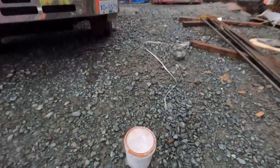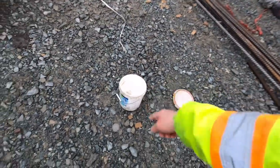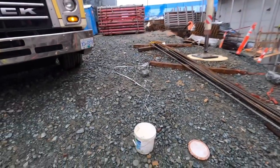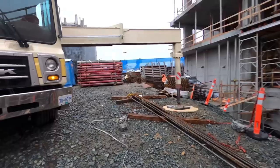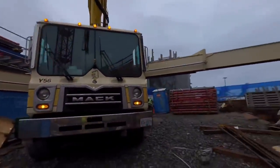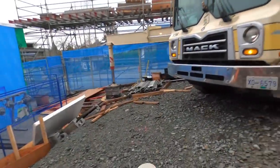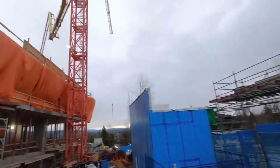That'll be it for today. A little bucket of bentonite right here - as you buy it, it comes in a 50-pound sack. You can probably fill this bucket five times over, so this bucket is about 10 primes - 50 primes per bag. We pay about $15 per bag - do the math, it's pennies per prime. We get the stuff from a local drilling supply store. It's called high-yield powdered bentonite - that's the name it goes by. In my opinion, 100% the best way to prime a boom pump, and the best way to prime a line pump too. Like, share, subscribe - over and out till next time.